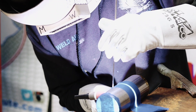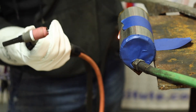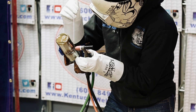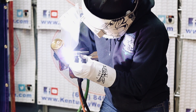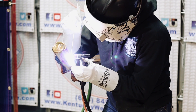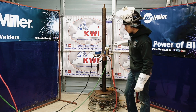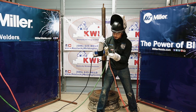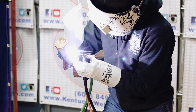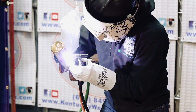The second step is tacking it up. When you tack it up, you want to make sure that you have your purge hose inside the pipe completely taped off on both sides. You want to make sure the pipes are square and you have the gap that you want, and you want to put a piece of tape over the other side of the bevel that you're not going to be tacking, to keep as much gas in as you can. You want small tacks on each side of the pipe — no more than, I'd say, a half inch.